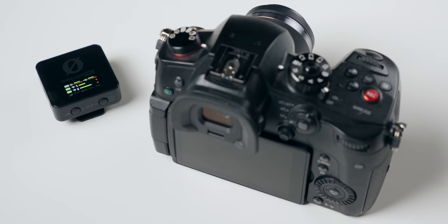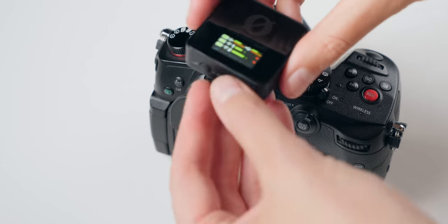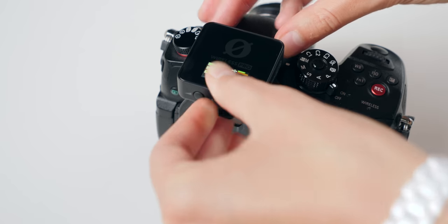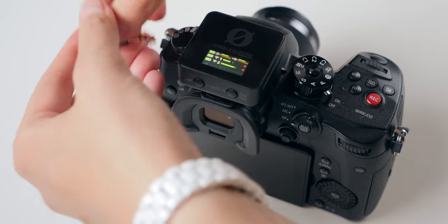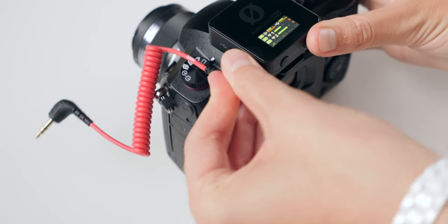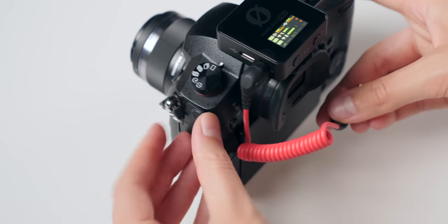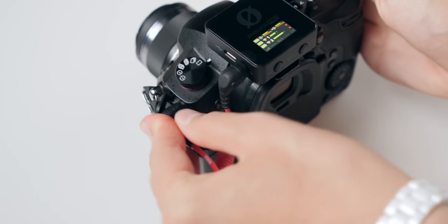So it counts up hours, minutes, seconds, frames. It'll still be frame accurate after 24 hours. So it's a highly accurate clock, regardless of the temperature at which you're recording, for the most part. And what it does is it actually sends the time periodically to the transmitters as well. So when you start recording on these, it imprints that start time into the recorded file.